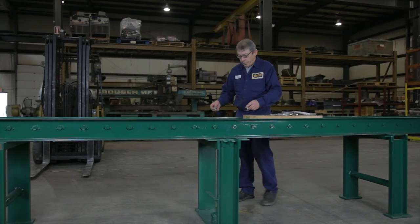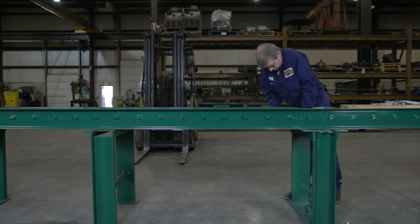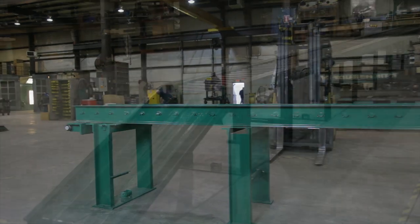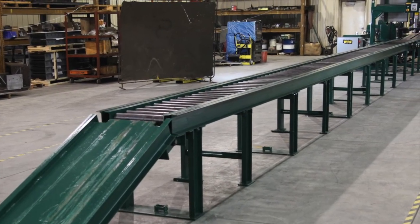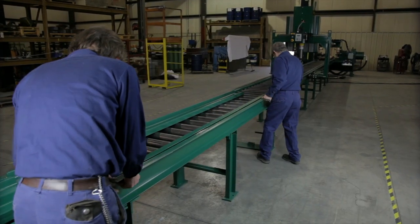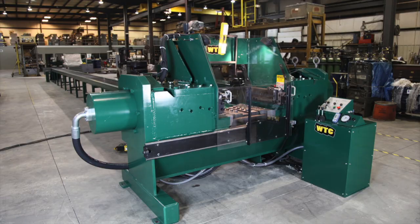Please note, the conveyor system and pad lift system parts are stamped with numbers to show their locations. See the accompanying floor plan drawing for details. If the optional pad lift system is included, loosely assemble the conveyor system parts and only tighten the connections after the pad lift system has been tested. Unpack the conveyor system parts and, for the pad lift system if included, begin by positioning the center legs and lift legs using the locations shown on the floor plan drawing. Turn all the lift legs so the manifold support angles are on the left side as viewed from the front of the track press.